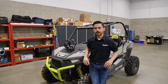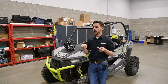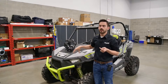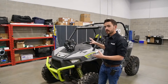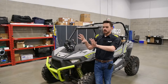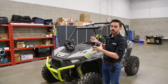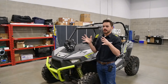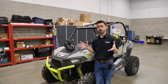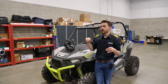We've got the C-Track and the Metroscan all calibrated and ready to go. There are a couple things to touch on before we get scanning. One is the reference mode that we put the C-Track into. This system is capable of what's called a dynamic reference, where we'd actually put a couple of reflectors on the subject itself and then the C-Track would lock its coordinate system to the object rather than to itself. It's a super helpful system if you're scanning somewhere with shop floor vibrations or if the C-Track isn't very stable or if the object itself is prone to movement. You can lock that coordinate system onto the object so that as it moves, the C-Track understands that and the scan moves with it. Where we are right now, we're in a nice stable shop environment with a nice concrete floor. Nothing's going to move in relation to each other, so we're able to operate in a static reference mode. The C-Track is going to assume that everything is static in its field of view and just track the Metroscan.